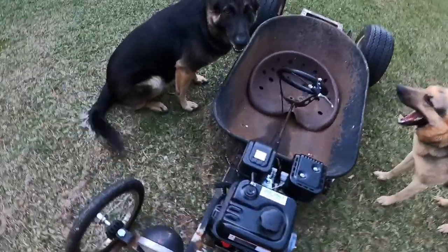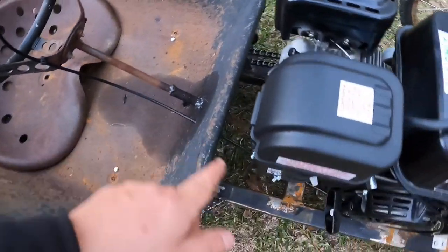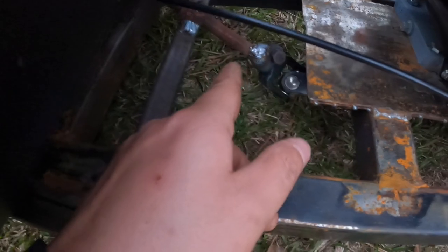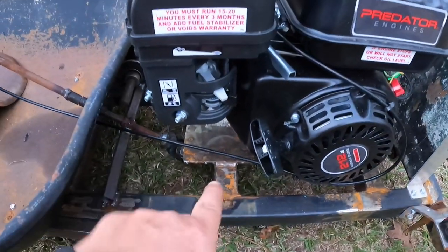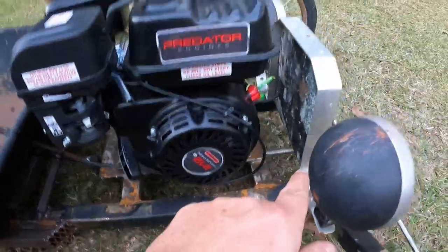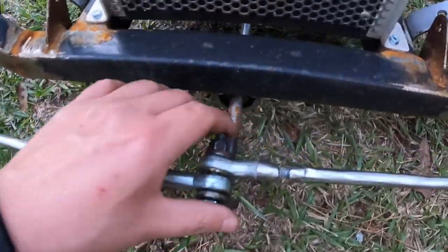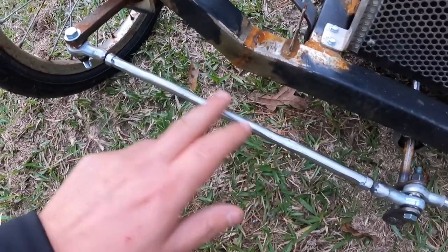All right, steering is completed, so went ahead and got it welded up there, made a brace down right there, come down to that joint. And I got it going under. I got a little sleeve welded under there, going to the front, to the collar right there itself, bearing. And I went ahead and put two Pittman arms on here to make it stronger. And it actually steers a lot better. Got that in place.